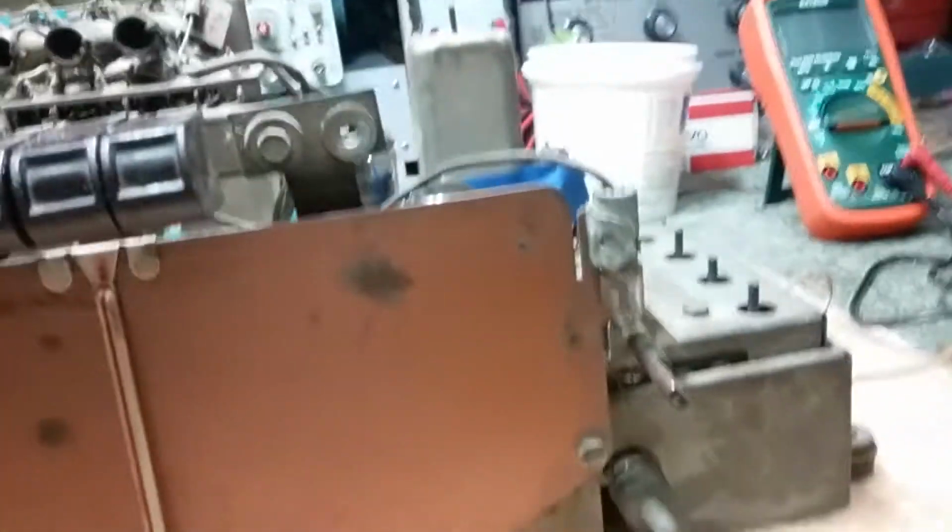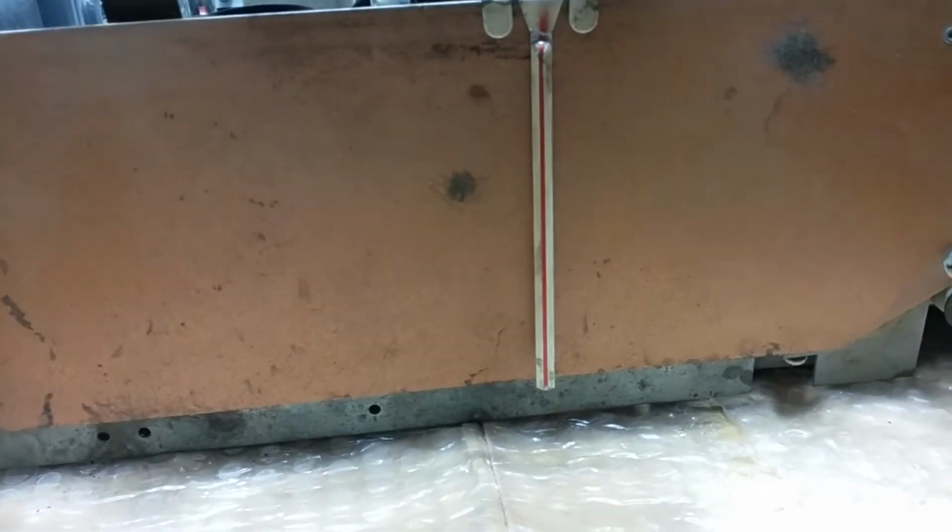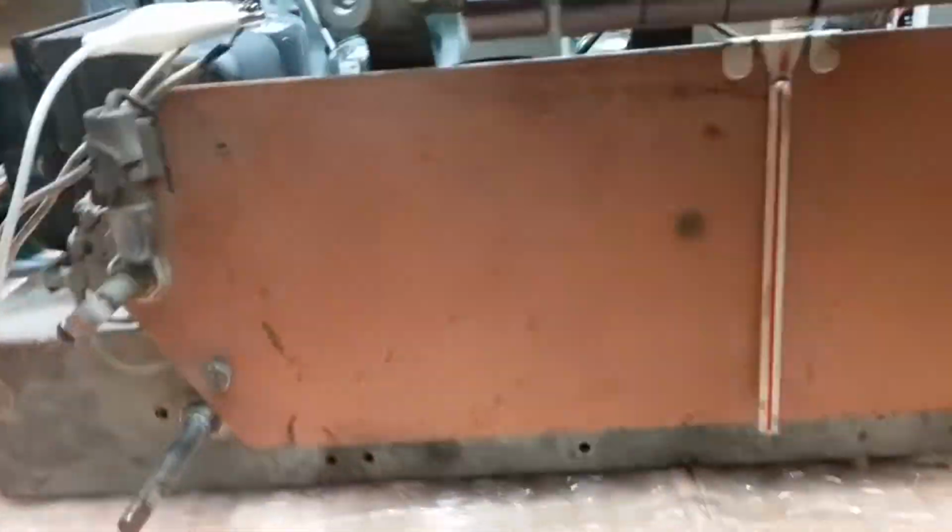At this point, the issue is most likely the capacitors. A bunch of them probably shorted out or open, most likely shorted out and letting DC go through. And it'll need an IF tuning, an RF IF tuning. And then I'll need to service that switch if possible, or figure out how to get around that. I think we can probably get it going if we clean it.